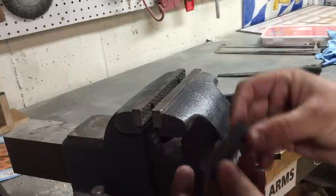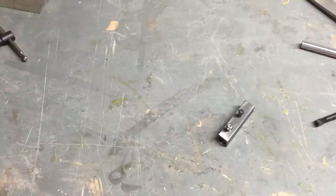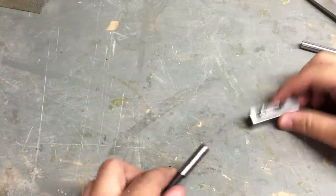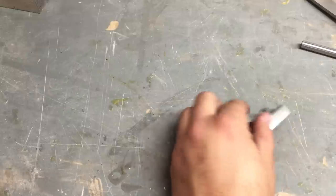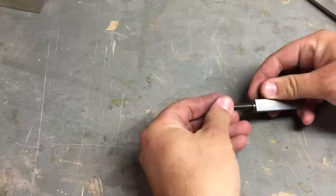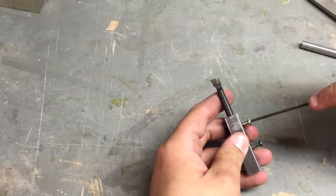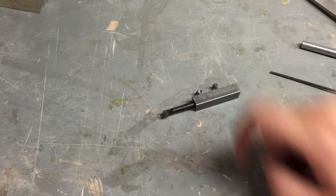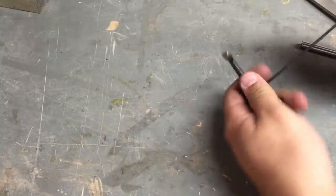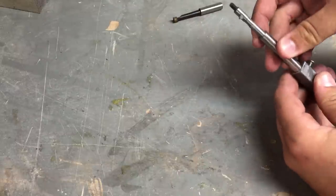Not super perfect, but a nice, quick, easy project. I don't have matching 8-32 bolts yet, but as you can see, this goes in the tool holder like so, and then we take our boring bar - carbide tipped in this case - slide it in, fits like a glove. Now our round shank boring bar fits in our flat four-way tool post. But wait, there's more - it also works for this internal boring tool with replaceable tips that I made out of some drill rod.